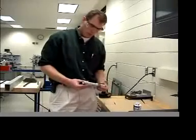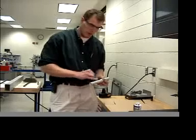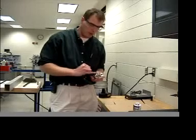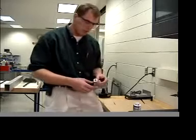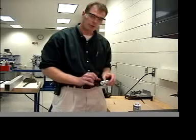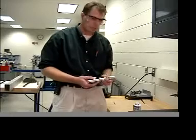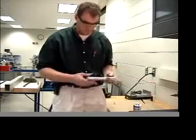Okay, we have our screwdriver blank out of the lathe. At this point we're going to measure heights off. One of the things you could do is, if you wanted to, cut off this end of your screwdriver as long as it's all 1 inch, if you think you have enough to get your 4.5 inches or 4.25 inches out of your screwdriver handle. Otherwise, you can leave it the way it is and grab it back here. It's just going to make it a little harder to balance on this next operation.